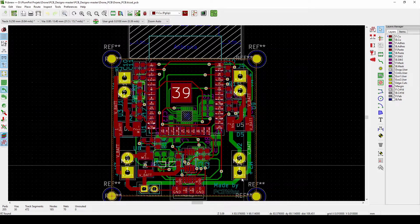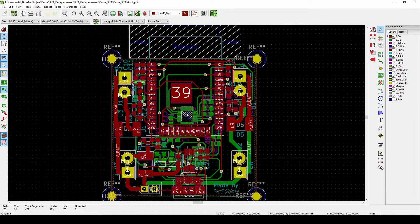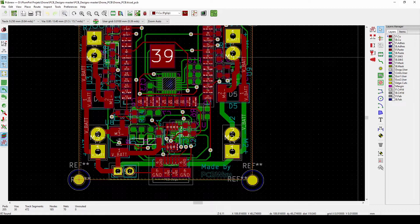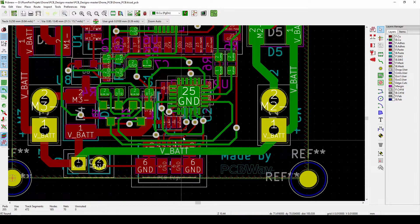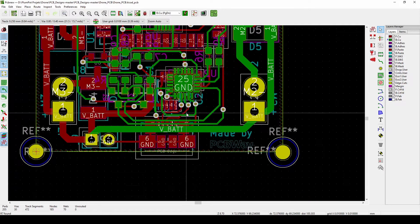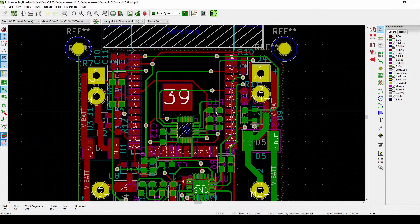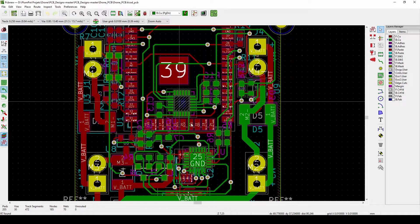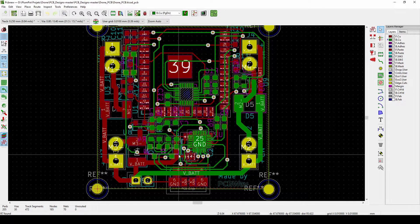I've got four connectors where I'm going to solder my motor wires, and the battery connector is there too. You can see the CP2104 at the bottom — the D+ and D- are differential pairs. It's actually quite slow so it's not too critical, but good practice is to make your differential pairs as short as possible. Keep the CP2104 as close as possible to the USB connector and don't make those tracks very long. I placed the MPU-6050 accelerometer right in the center of the board so that when it rotates in X, Y, Z I don't need as many correction factors.